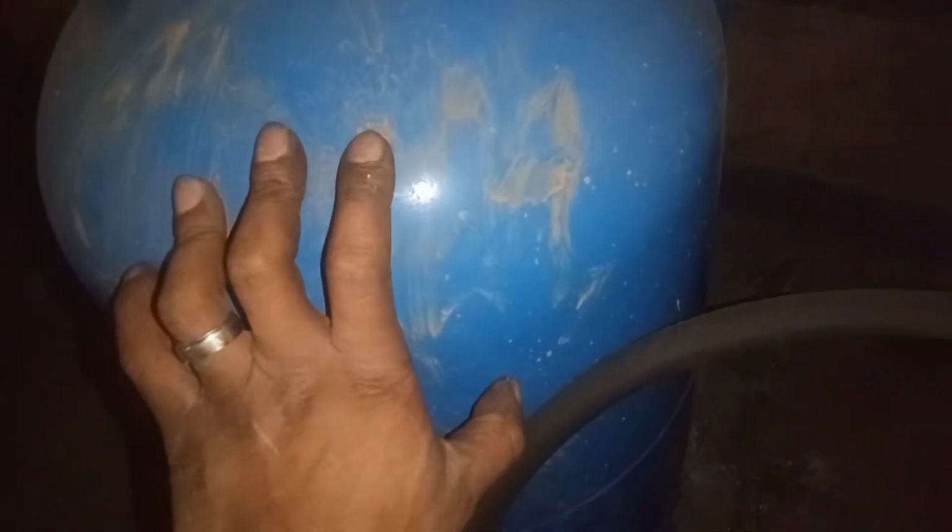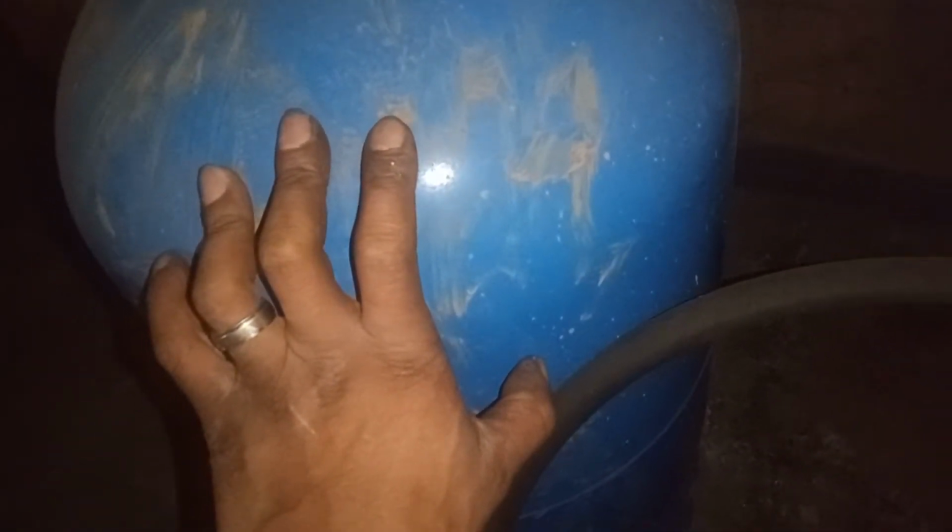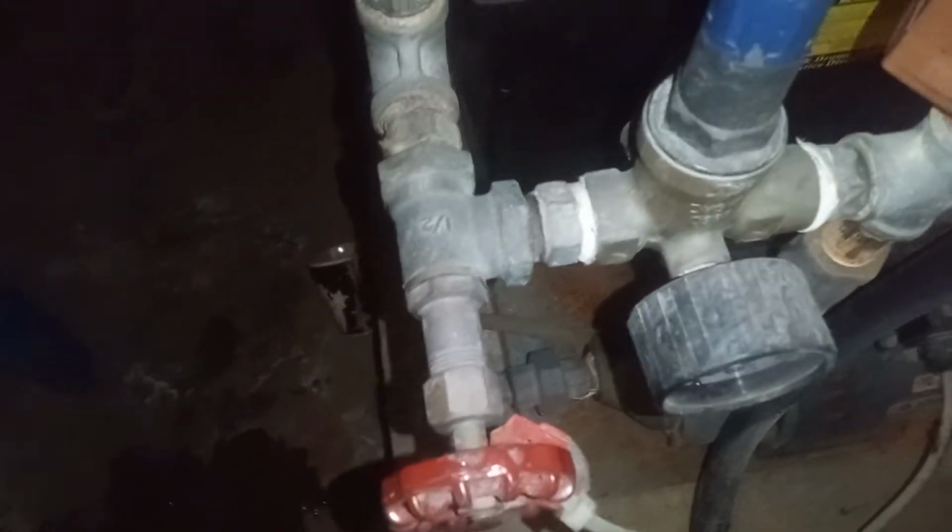So I checked my pressure in this expansion vessel connected to the pressurization unit. It's got about 0.5 bar. Gonna check the data badge, see what it needs to be pumped up to. Up here looks like my high alarm. And then over here we have our low alarm and so on. Then it looks like we have our set pressure here to about 2 bar.